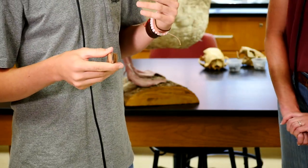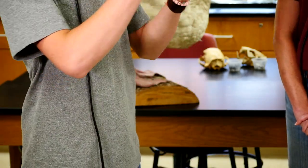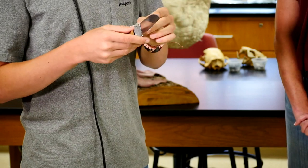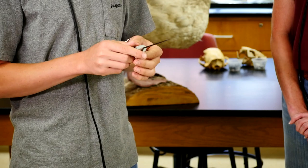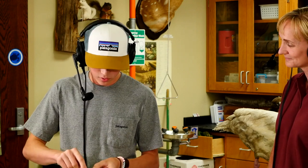A lot of people in the knife-making community, the first thing you do is pick up somebody's knife and see how good it is. This one's near perfect, because I really spent my time on that one. But a lot of times that's one of the hardest things to keep even. And when you're grinding and go from side to side, your body naturally does two different motions. So one side at the top will end up curved and the other a super straight line. It's really hard to keep consistency in your bevels and have the same top line.